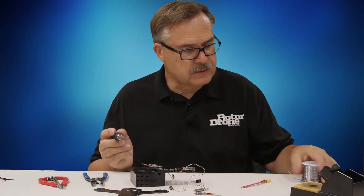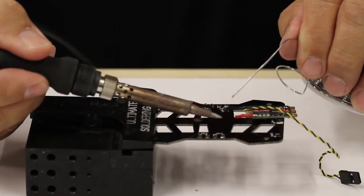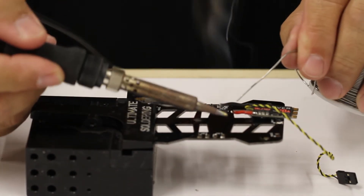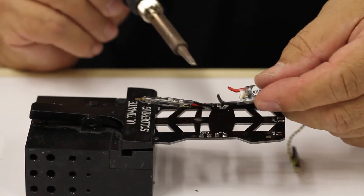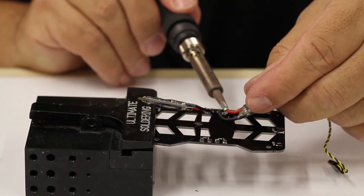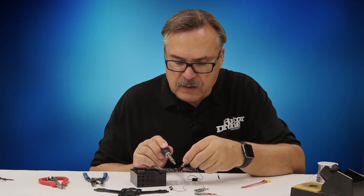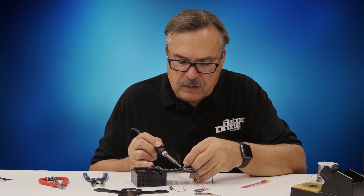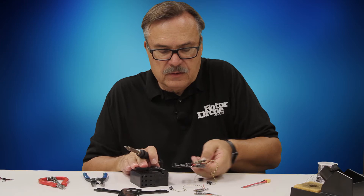I'll tin this next one up and get it ready — a little bit of solder on the soldering iron onto the ESC wires, and that just happens real quick. There's not a lot of heat transferred, though you're still going to get some heat — there's no way to avoid heat. I accidentally moved that one a little bit. It probably wouldn't hurt it, but I like to get them dead center if possible. You can tell when your joints are done well: there will be a nice shiny little droplet of solder right there. Those look good.